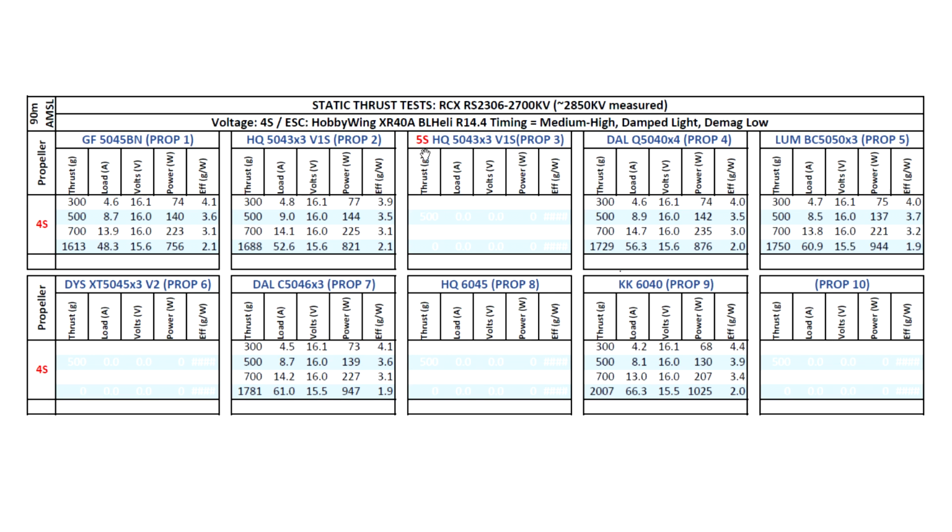I definitely didn't want to test this on 5S because it would just smoke something, either my ESC, the thrust stand, or the motor itself. It's just too high a KV for the thrust stand. And on the heavier 5-inch props, it's clearing 1700 easily. Of course, this comes at a cost of high amps. So you'll definitely need a good battery if they leave it as is. But I imagine they're going to lower the KV a little bit so that it's closer to 2700.